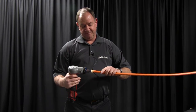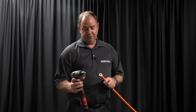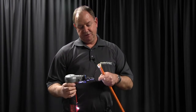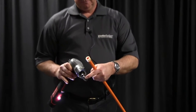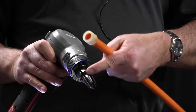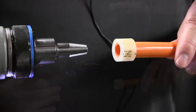When you put the tool in, every time you pull the trigger it'll give you a little rotation. The whole purpose of that rotation is — if you can see the teeth on the tool — if you do not rotate the tool, you're going to have a possible leak path. So we want to do seven to eight times on this.